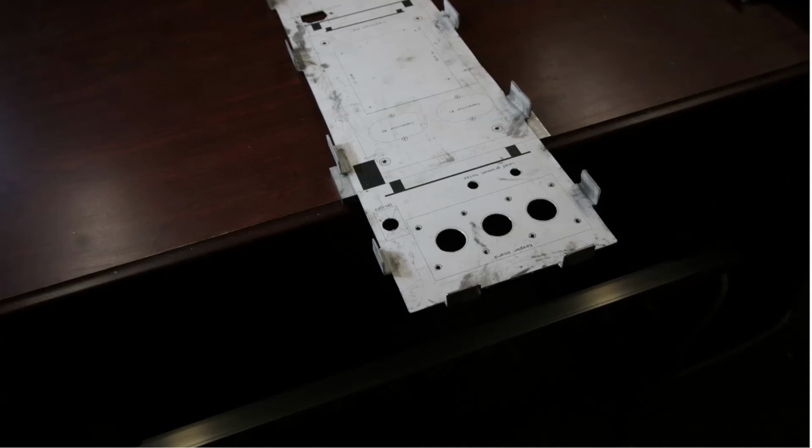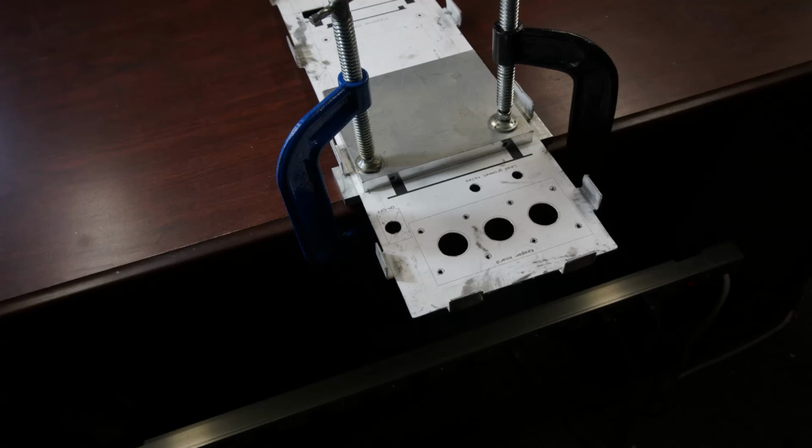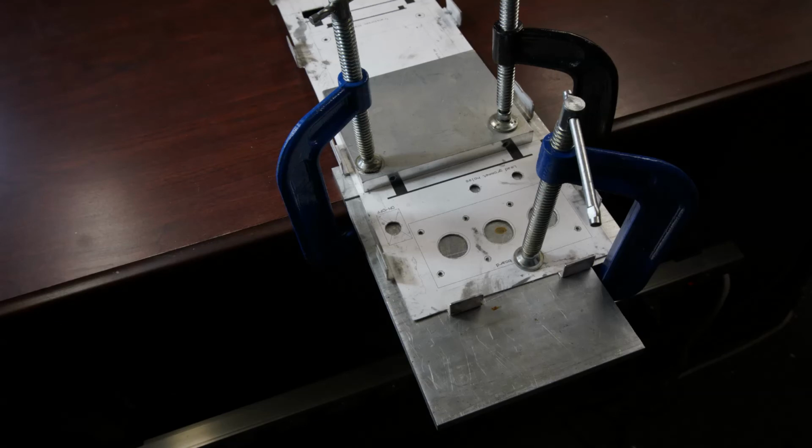I've placed a metal backing plate beneath the piece with its edge along the line of the proposed bend. I've clamped another slab of metal on top with its edge coincident with the line of the bend. Lastly, I've clamped a third slab underneath and pressed it butt to butt as tightly as possible against the edge of the first slab. As you pull up on the end of the overhang, put as much force as you can on the bottom of the assembly in the neighborhood of the yellow bend line.